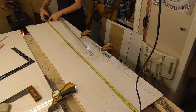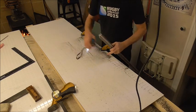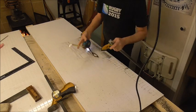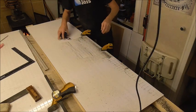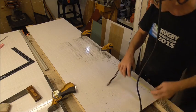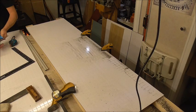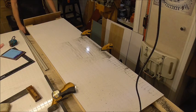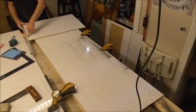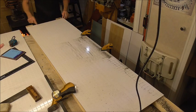And here I've got 1705. But that's too big because we're using this on the outer nose there. And that means that there we've got to deduct that amount. 14 mil. So yeah, standard 15 mil we need to take off of it. So I can feel there I've got a tile edge there at 1 centimetre. Here I've got almost an edge. Now as we turn the corner we've got half tile, but we're not going to be trying to perfect the half tile. There's a good chance a lot of that will disappear anyway. We're near the edge of a tile. Coming around the corner, we're not going to bother too much about it. So what I'm going to do is trim this till it's level with that tile.